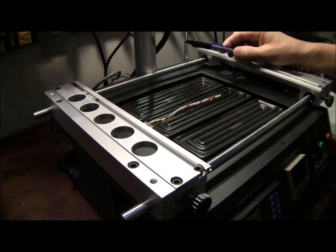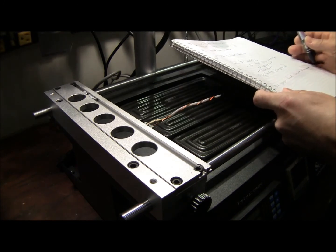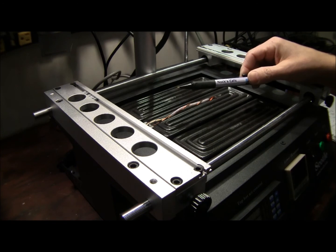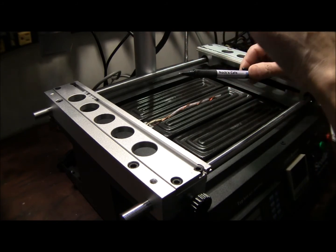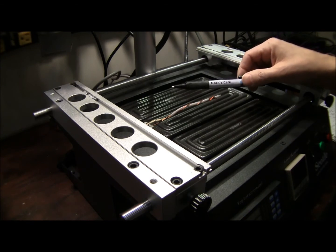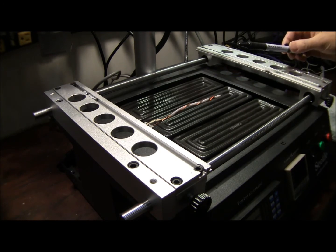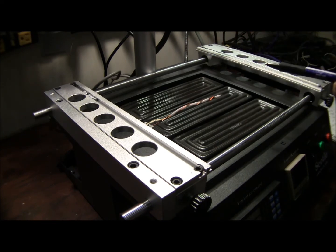Back to the lower heater: it needs to be accurate and run at the right temperature. If your board is here and your probe is a quarter inch below, setting your preheater to 180°C should make your board 180°C. You'll find that with the probe just below the board within the heating zone, setting it to 180°C will make the board pretty much hit that temperature. On machines like the HR6000, Honton 390, or 490, probes were originally mounted right against the plates — most foreign machines do this.